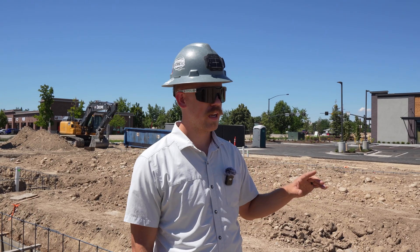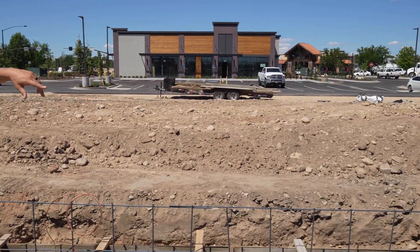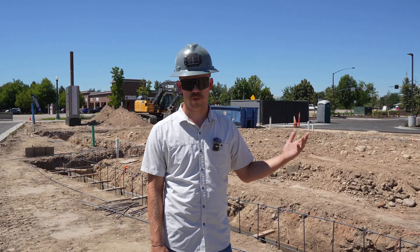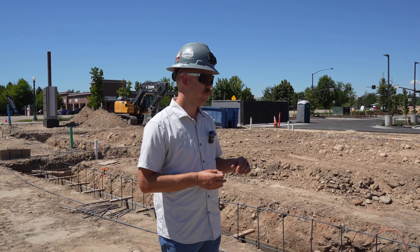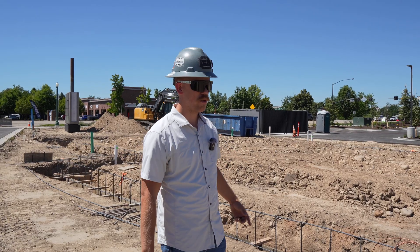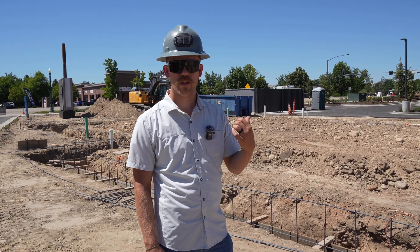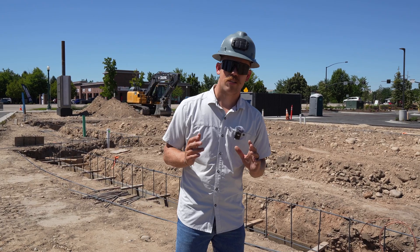This is typically the first thing we do on most of these commercial projects. A ground-up building like this almost always requires a Ufer in the building. The next thing we're going to work on is some underground conduit — like I was showing you in building 5, we have to get some conduits through the foundation and over to where the switchgear is going to sit, and get them inside so eventually they can be hooked up for the tenants. There's also some conduits that are going to run along the exterior for landscape power or lighting. After that we wait for them to frame and get the building dried in before we can start pulling wire.